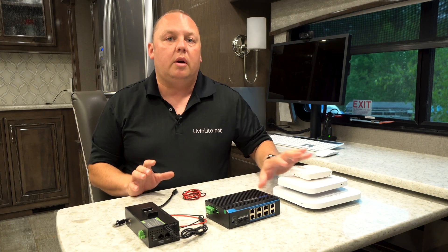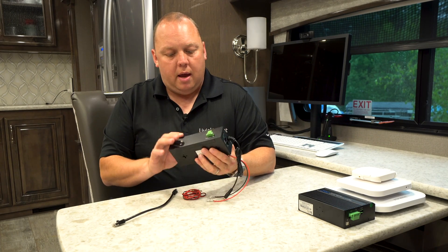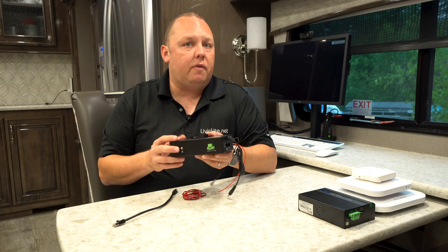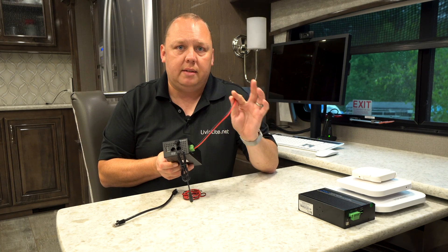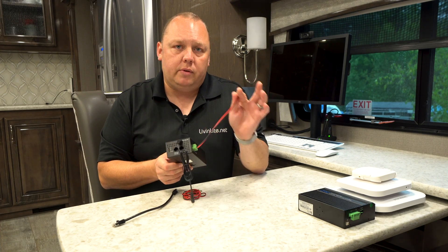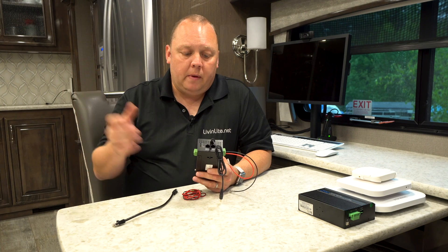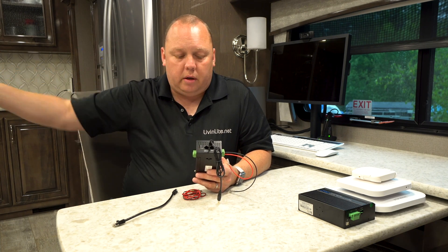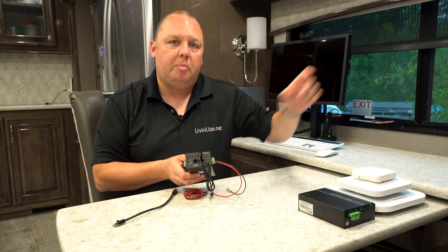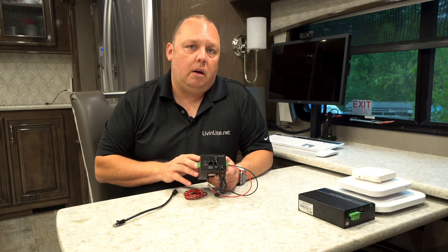Let's start with our first, most basic but feature-packed PoE device that can provide power over ethernet for your access points — this little guy. It's called a two-port switch, but I like to call it a PoE injector. What makes it different from most PoE injectors is that it accepts 12 volt DC power input and then up converts that voltage to 48 volts all inside this little box. So if you provide fused DC power to these two cables here, it will output 48 volts to the access point. You could power up an access point anywhere in the coach and uplink it wirelessly to the PepWave, or we recommend using this data port to connect to the LAN port of your PepWave for a wired Ethernet connection, which is optimal for best wireless performance.